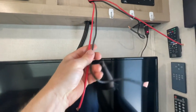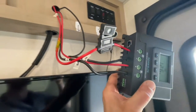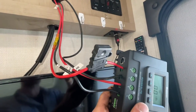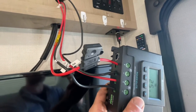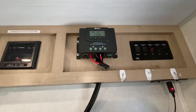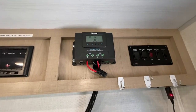I've got everything tested out. Here are my battery cables, and I've printed off some labels to mark which are coming from the battery and which from the solar panels, so in the future you wouldn't need to test any. I also added a fuse holder to the solar line — there's no way to turn off the panels, but this protects against a short and lets you pull the fuse to power down the solar input to the charge controller. Just like that, the charge controller is installed. Now we're going to go up top and get the panels on the roof.